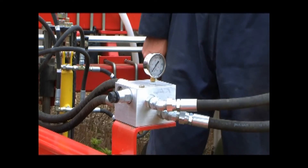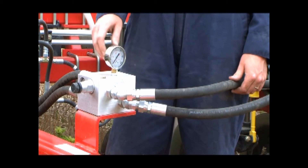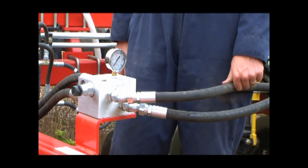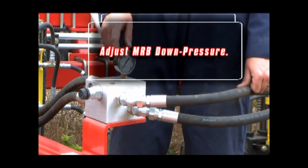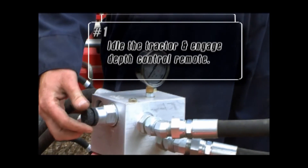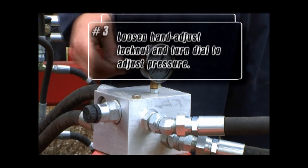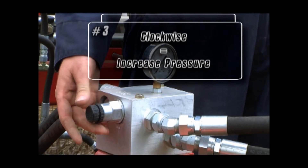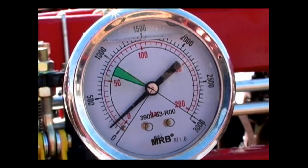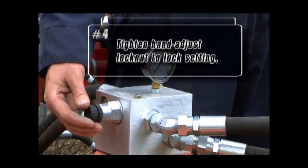The optional MRB down pressure control block is located on the right-hand side of the drill hitch. The MRB control is synchronized with the PHD hydraulic control so the MRBs will cycle with the PHD openers when you flip the switch on the model 400 control box. The MRB down pressure control is not adjustable from the cab and is only adjustable on the frame. To adjust, energize your PHD pressure circuit in the down direction and read the pressure setting on the gauge. Loosen the hand adjust lock nut, turn the dial clockwise to increase pressure or counter clockwise to decrease pressure, watching the gauge until you reach the desired pressure. Once done, return the lock to keep it from vibrating into a different position.